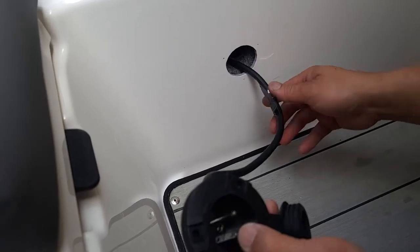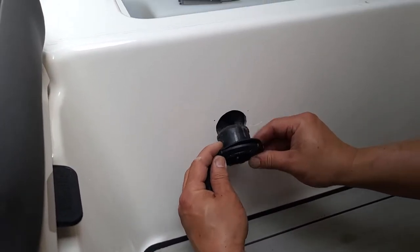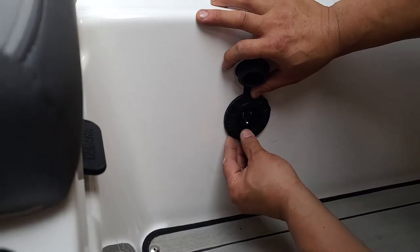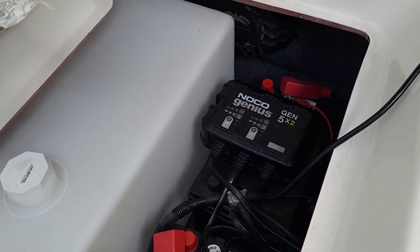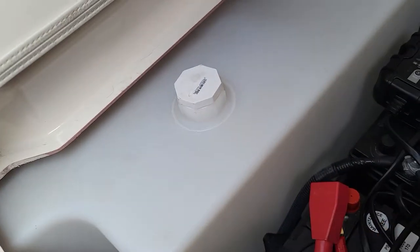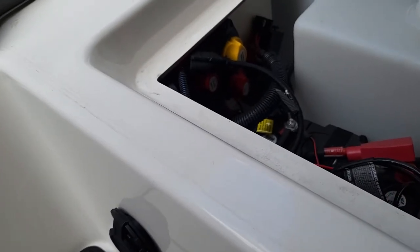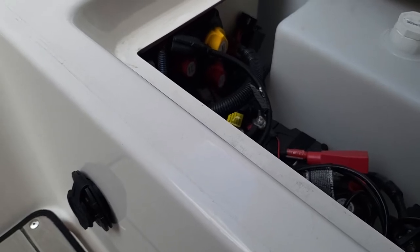Oh, I slipped and scratched it — oh well, we'll try to buff it out. There you go, perfect! Now we just have to screw that on. The screws are self-tapping, so that's easy. Now this is in here and we just have to connect it to the NOCO tender right here. We can clean up all these wires and get everything nice and clean in here. The only time we'd have to open this is to turn on the house battery and starter battery, but now this is all nice and clean. This is basically how we are going to tender our house and starter batteries when we bring the boat home.